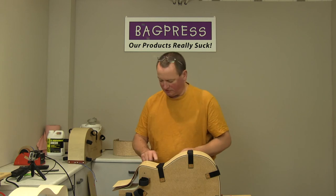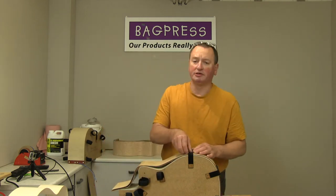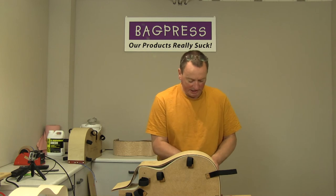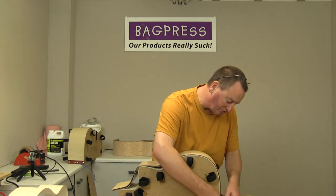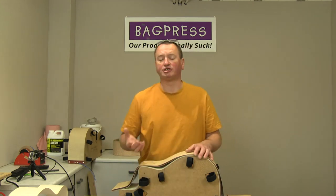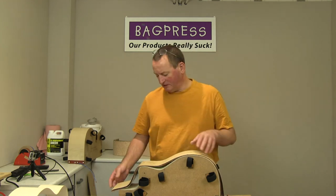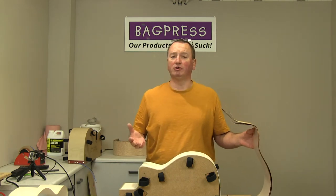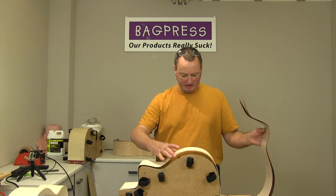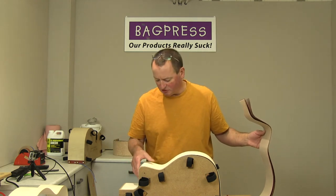Now this particular shape of guitar with these two very tight bends on the cutaway, it does make it really quite a challenging shape to bend using a bending iron, using traditional sort of solid wood sides and heat. But with the veneers, laminating the veneers, it makes that whole process much more straightforward, much more accurate, much more reliable. You know, it's not impossible that you get a failure using this method, but it's considerably less likely than if you're heat bending sides using a traditional bending iron, especially if you're using tricky woods, like the bird's eye maple, which is notoriously hard to bend. So again, you can see it's the finished component, and it is pretty much spot on the shape of the mould. I mean, there's virtually no deviation from the mould shape there whatsoever.